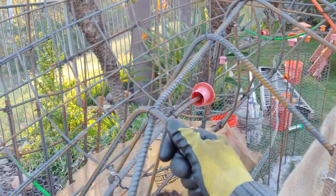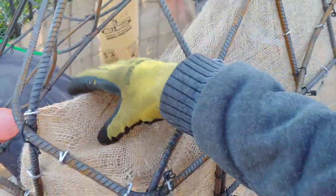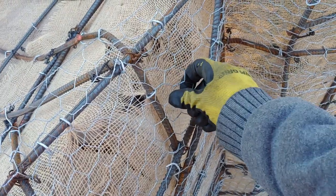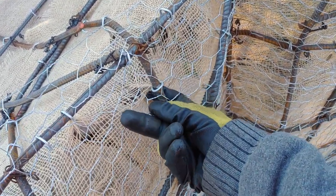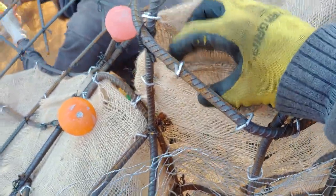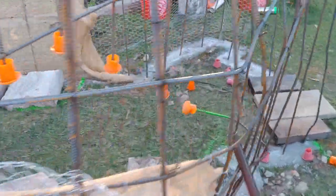That's how we do it: you get your steel shaped out into the rock shape you want, you come back with your burlap on the inside — I've covered this in a zillion videos — then you come back on the outside with the chicken wire and blast it with the shotcrete. That makes it really, really strong. The shotcrete pushes the burlap back in, so you do have a closer little spot there, but it's much smaller. If you have the shotcrete pump really blasting on that spot, you end up with good coverage.